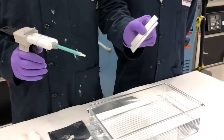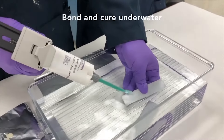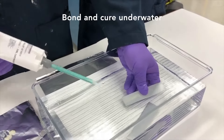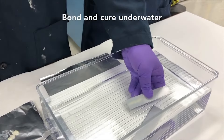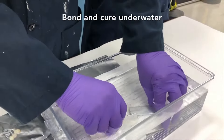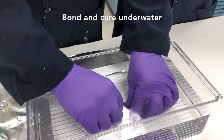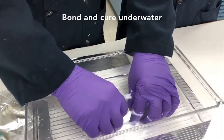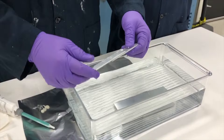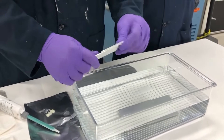We'll take both coupons — we're using aluminum for today's demonstration — and we'll actually apply a thin bead of adhesive underwater. Not only can it be applied and bonded underwater, it can also be applied and will cure at extreme temperatures as low as minus 20 Celsius. General pressure is applied to the substrates being bonded together. While that will finish curing underwater, we're going to pull a small piece out that was bonded less than 10 minutes ago. As you can tell, this has already developed very good handling strength.